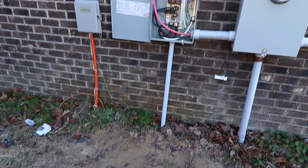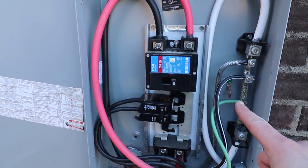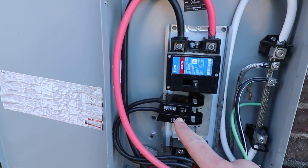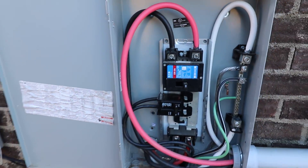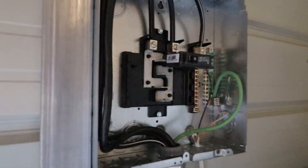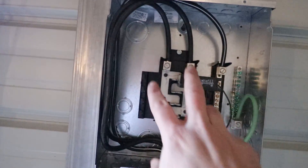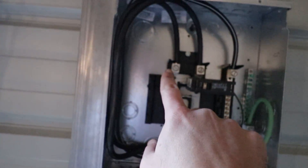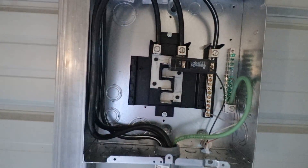I didn't show everything because we now have covered up the ground and buried the wire, which is wonderful. In here I still have the breaker off. We have wired the neutral and the ground, and we have also wired both of the 120s to the breaker. All we have to do is flip this on to test everything out, and I will take you inside. We put in one breaker so we can see if the electricity is going to work. Up at top we've got the 120 coming in on each side, the neutral which is the black with the white, and then we have a ground bar. Everything should be wired up correctly.